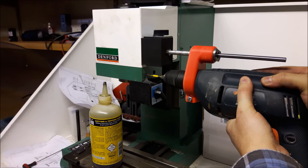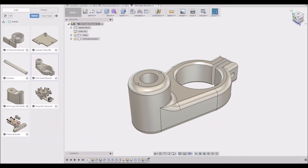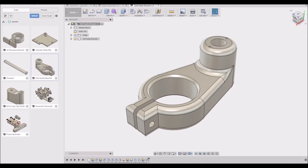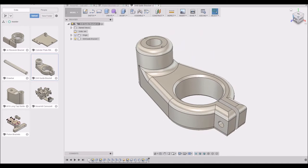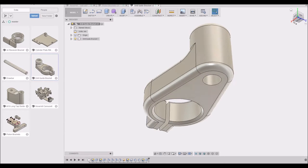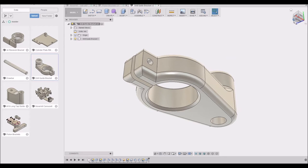A bit of a bright idea: build my own mag drill. This is a DTI stand with a piece of linear rail bolted to the top. There's a 3D printed part I designed myself — it holds the drill in the large diameter and a linear bearing in the small diameter. Fairly easy to knock up in Fusion 360 and print on the 3D printer, and it seemed to work really well.